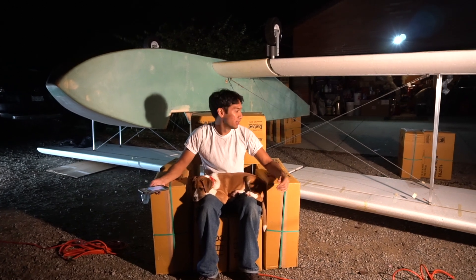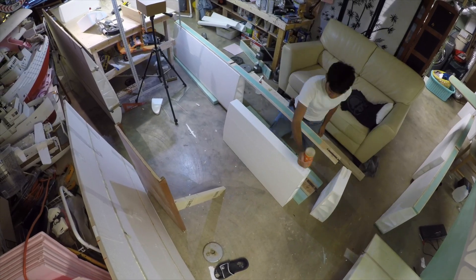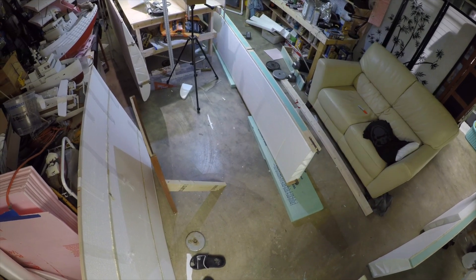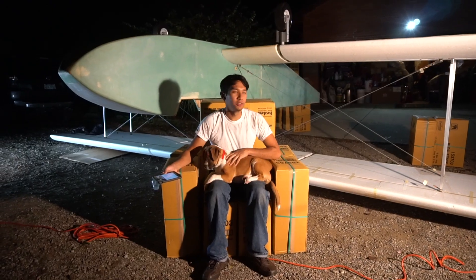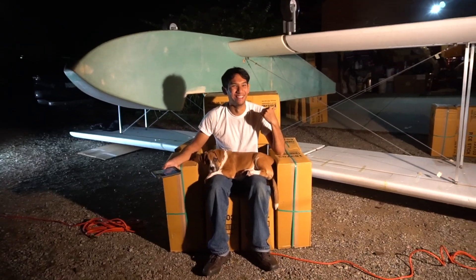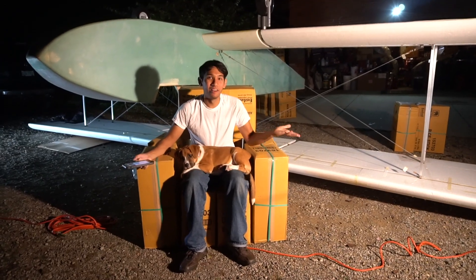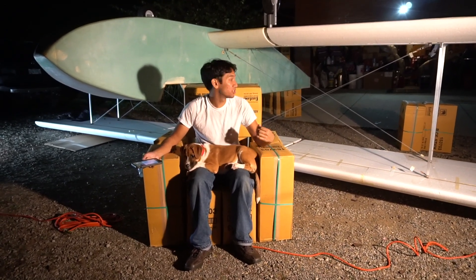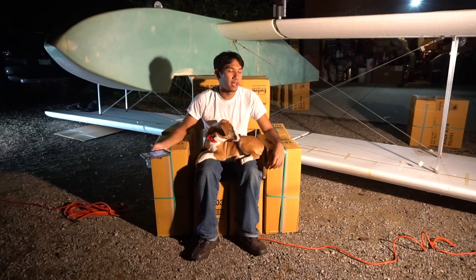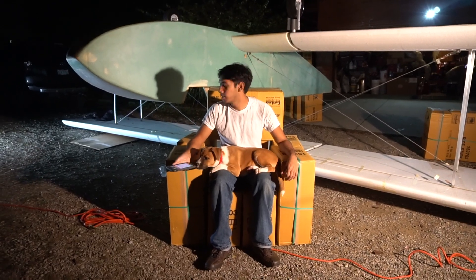I copied other planes that I've seen, such as the foam shear web going for this bottom wing — that's actually copied off another airplane called the Sky Pup, which is made out of foam and was designed by a Cessna engineer. If that thing is strong enough and doesn't have flying wires, I should be all right. Do your research. Also, be sure to ignore some naysayers, like the people that told me this thing is going to be like 500, 600 pounds. I weighed it — 170 pounds on the scale as-is, minus the tail section which is 10 pounds.